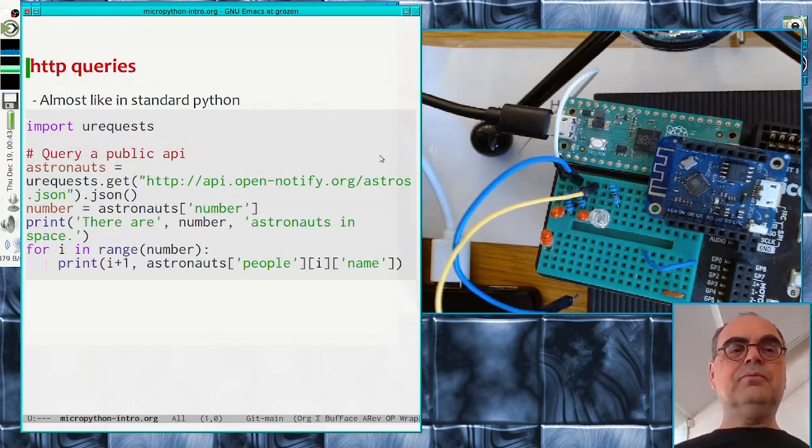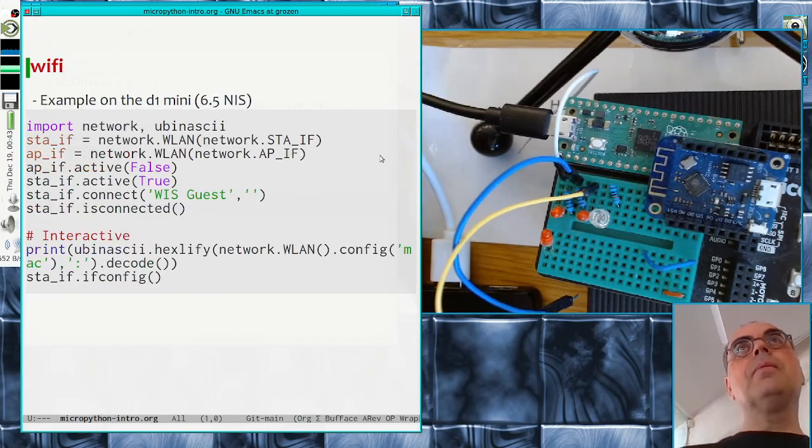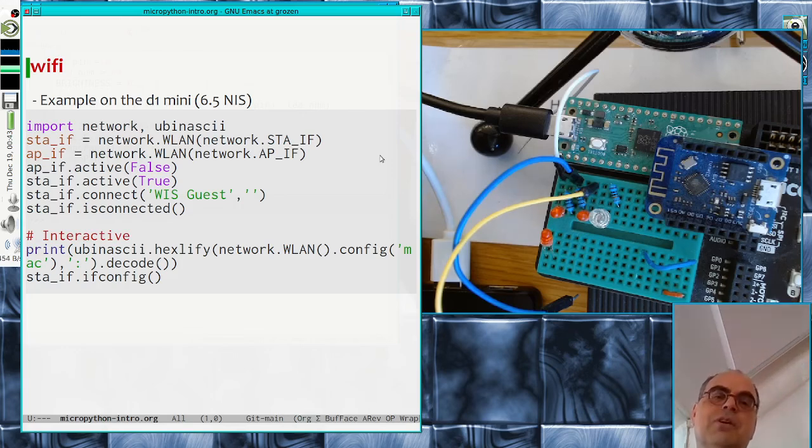So you upload the Wi-Fi connection file, the .py. Then do you have a separate file for the server, or will it be all in one? The way it works is that when you boot the chip, it runs the main.py, and Python can do import, so it can import whatever it wants. Or you can quite easily write the web server yourself.